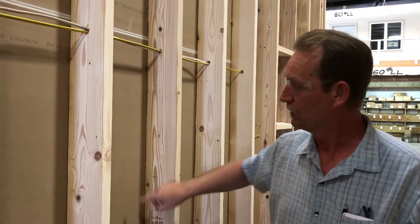Not only do we glue all of that sheeting, notice every piece of drywall is glued and screwed — exterior walls, interior walls, all the way around the house. A lot of people think you have to use special closed-cell foam or spider fiber to achieve a really great insulation package, and that's simply not true. By doing this, you create little individual spaces and an envelope so tight that air simply can't escape. Air gets into your home, pressurizes, and takes the path of least resistance — this glue application stops that air movement all the way around the house.